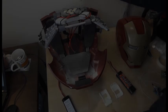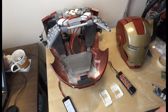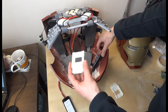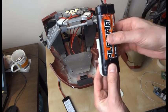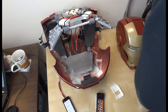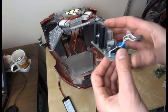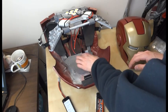Let's have a look at where the electronics are going to fit. Here's the back of the torso with the front of the unibeam on, and the plan was to put the battery somewhere in here. I've got this metal thing and there's actually quite a big cavity behind it where the electronics were going to go. I was going to mount the batteries each side of it, and I've 3D printed these special battery holders which I can put a strap round so they can be glued onto the body. Those are going to go somewhere at the sides, and then we'll hopefully squeeze those little boards underneath there. I may need to chop a piece out of this panel, and I'll have to unscrewing the heatsink and flatten the resistors that are sticking up so that it fits underneath - hopefully we can get all three boards in there.